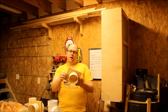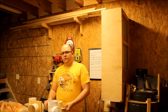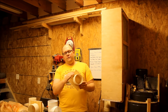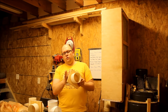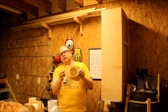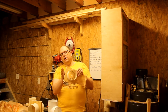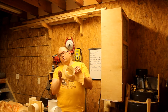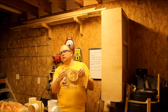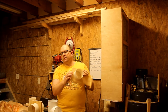These do a really good job at sealing off the air. I also used foil tape to make a little flap on the end — the purpose of that flap is so when you close the blast gate, any accumulated dust can get pushed out. But when it's open and the vacuum is on, the flap hangs just over the opening and the suction sucks it closed, so you're not losing any suction power through the blast gate openings.